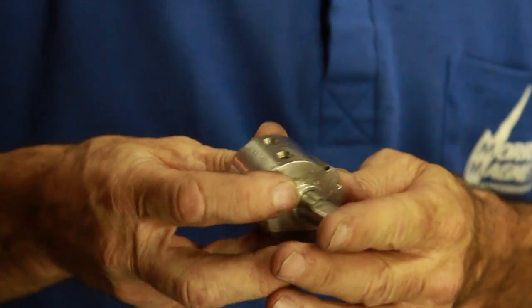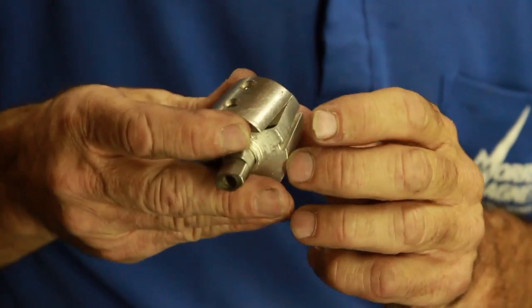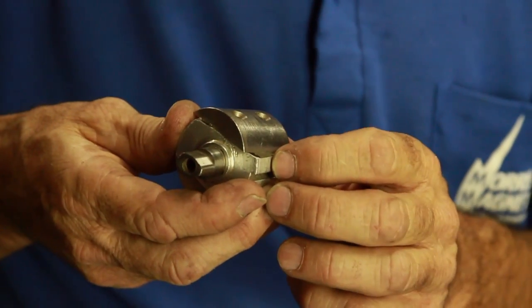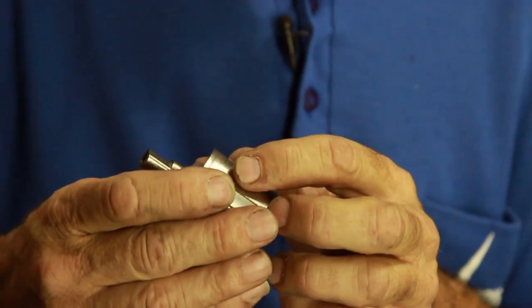There's also a rotor out here. I've been asked a number of questions about four-magnet rotors — this is a four-magnet rotor. What's done is four magnets are milled in in segments, with a gap in between them, and a cover is put on with screws that hold it together. What happens with this is you get a great deal of eddy currents. Every half turn, this thing wants to lock up — it takes about three times the force to turn it past the magnets as our rotor.